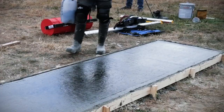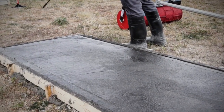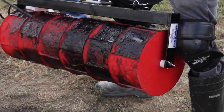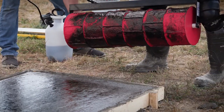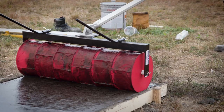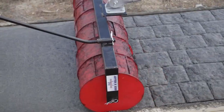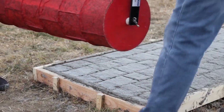Using the Rock and Roller is simple. The first step is to spray a release agent on both the uncured slab and around the cylinder of the Rock and Roller — this will prevent the roller from sticking and lifting the concrete as it rolls across the slab. Next, place the roller on the end of the slab, then slowly roll it across the slab, carefully lining it up on the edges as you go. Remove the roller once it reaches the other end.